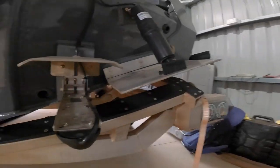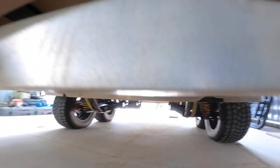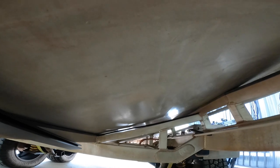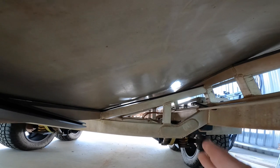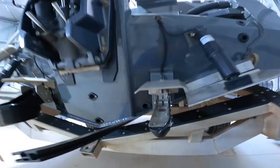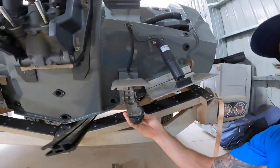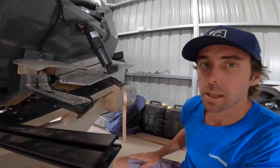Another little thing you just want to make sure when you're setting your transducer up — mainly for when you're fitting it for the first time — because you don't want to have to drill holes all over your boat if you don't have to. So make sure where you want to put your transducer there's nothing underneath on the keel of the boat. This line is where the transducer sits on this boat — it's perfect, there's nothing that sits in through here. You need to be careful with that. If there's any sort of little lumps, any scratches or anything like that, you're going to get bubbles that come off the bottom of your boat and they're going to come through here, and you're not going to get clean water on your transducer. That part is very important.